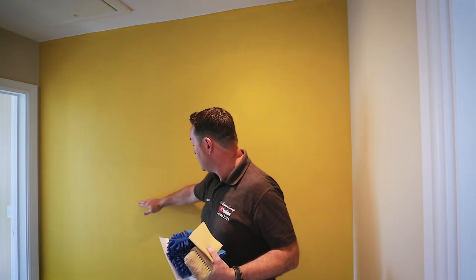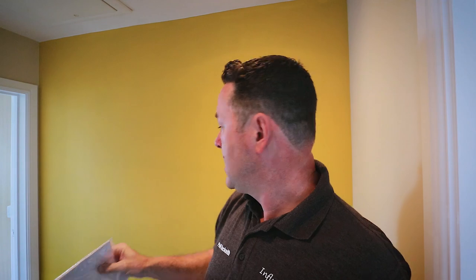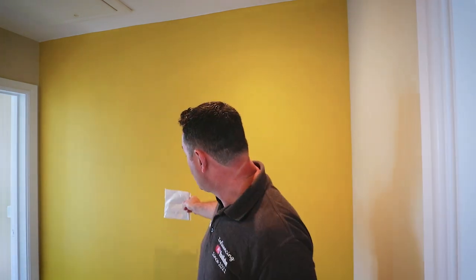I'm going to find the middle, and I've already actually found it, but I'm going to use a spirit level on the floor to find a horizontal and a vertical, because these gold leaf foils are individual sheets. If I've got a rough idea where the line is, I'm going to hang them, it's not wallpaper, and keep them vertical and horizontal. When the gold leaf is on, it won't define on edges, so you won't see a paper edge where one is slightly off. The whole wall will be gold as a solid.